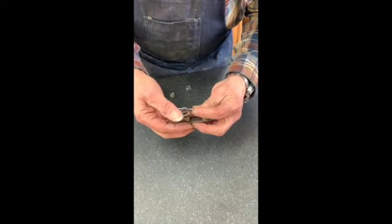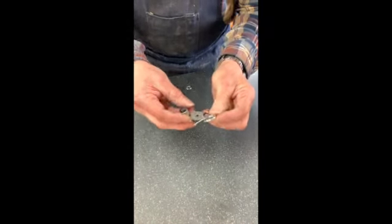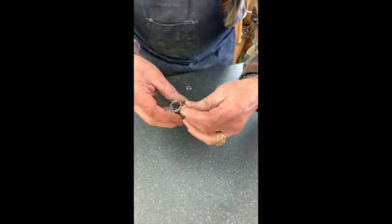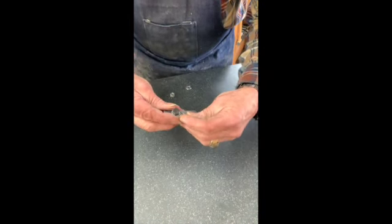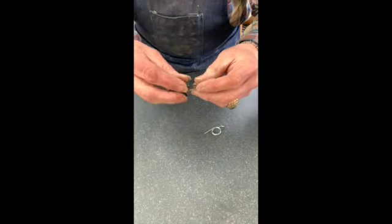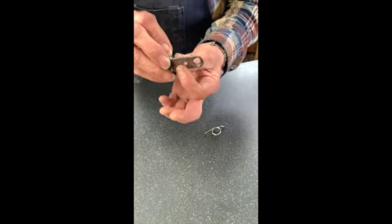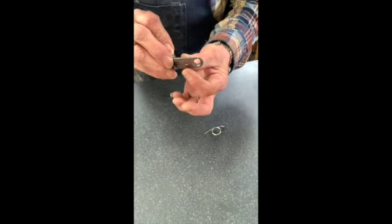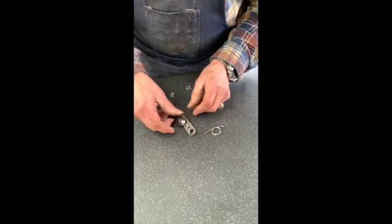And that has to be this size to accommodate this diameter. But you see how the spring's much larger, and that's done because when that spring compresses, its diameter decreases. So they did do some thinking, but it's caused some trouble for me because I don't have steel this dimension and can't get it for several days, so I'm going to try a couple of tricks of my own.